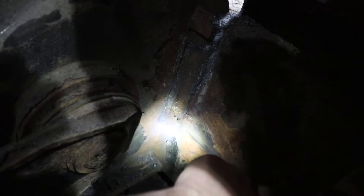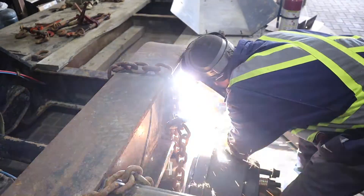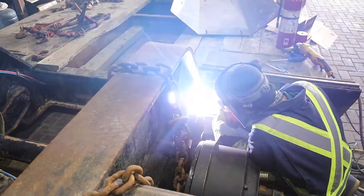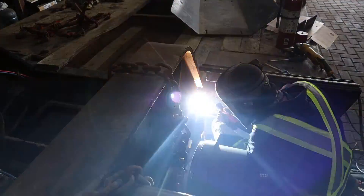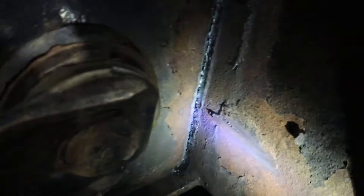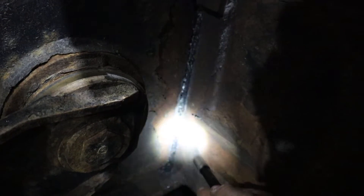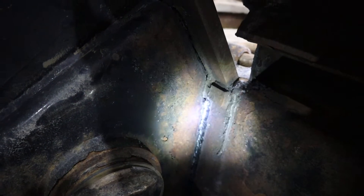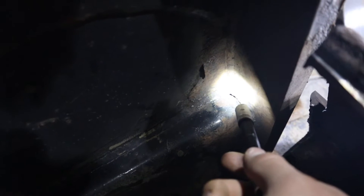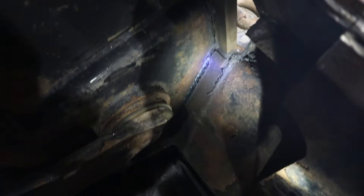The crack terminates somewhere in there, but I'm going to gouge all of it to make sure. There it is — gouged a bit into the bottom flat weld. The crack ended somewhere here, but just to make sure I took a bit extra out, going around that frame portion, and into the corner here, which is possibly where the crack started. It seems to have ended somewhere around here. I still need to do some more grinding with a pencil grinder in there, then prep it all out and weld it up.